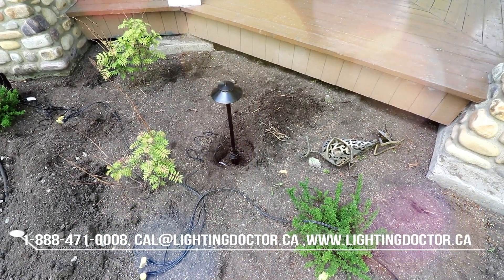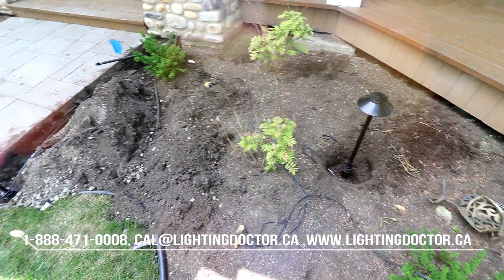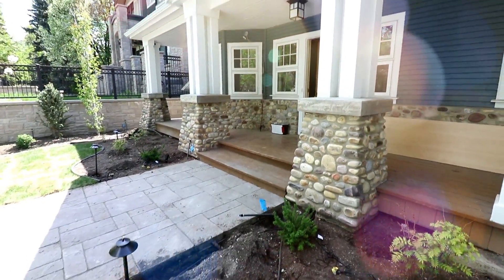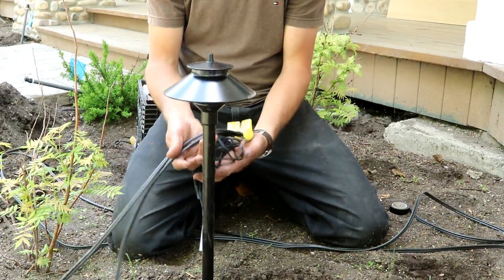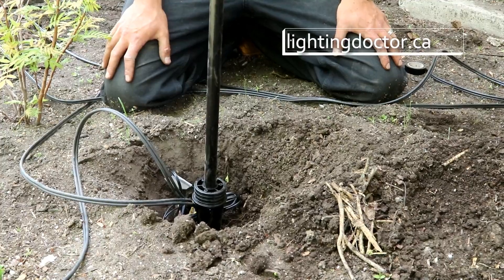Now that we've selected our lights, you've got to go and just place all the lights roughly where you want them. You're going to want to come back at night, see how everything looks because you might want to make some adjustments. Usually I'll go around, dig a small hole, place the lights, get them set where I think I want them, and leave lots of room. I always suggest leaving lots of extra wire at every single fixture so that if you do need to move them, you're not having to cut wires — you can just move the light around and you've got lots of wire to play with. And the other reason you want to dig that big hole is so you can easily hide that wire and bury it nice and snug when you're all done.